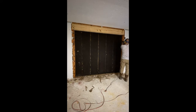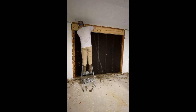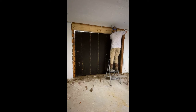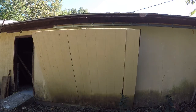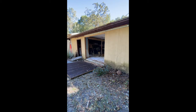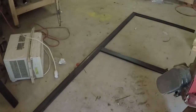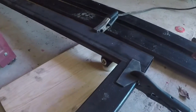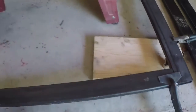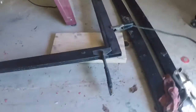I then used a sawzall to cut the opening for the door. To make the barn door I used one-by-three steel tubing. To make sure the pieces are not twisted I used the three-point method by resting the metal on three old pool balls. I did this for the two pieces for the opposite corner as well.